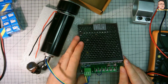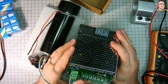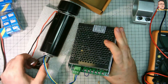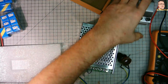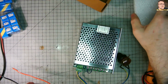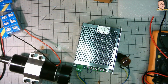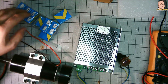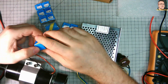At the front, the first problem is no polarity mark on the output. You can see it's just the motor label, and it's nothing positive, negative. Something in Chinese on the label above the motor, but I don't know what it means. It should be clear information, plus, minus, or positive, negative, because the spindle will rotate in the wrong direction. And when I start using this, it will be not good for the bits, because then it should rotate in the proper way.